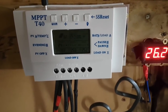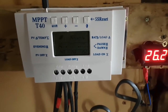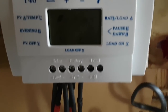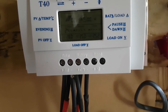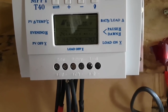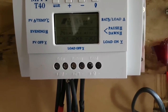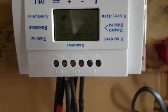Been a little while — ticking up nicely. One to two amps going in at all times in this bad weather, still good. To use the power now, I'm going to hook in some 24 volt stuff into where it says load. If you're going to put more than just a light on this, you basically want to put this to a little 24 volt breaker box and then to all your other stuff. Use this like you would a house for your mains grid — your input, then breaker box, then other stuff.